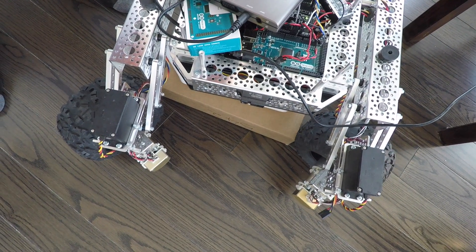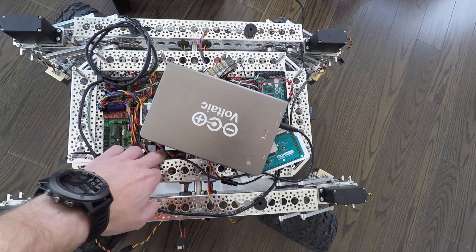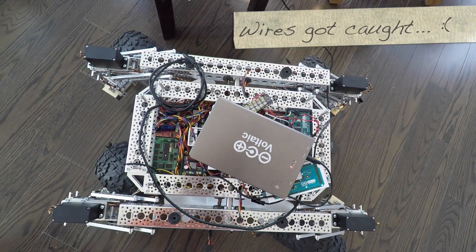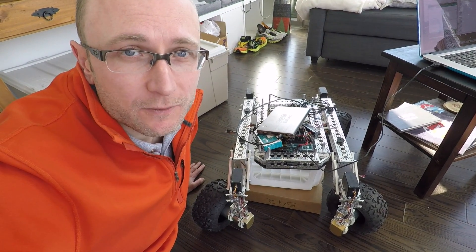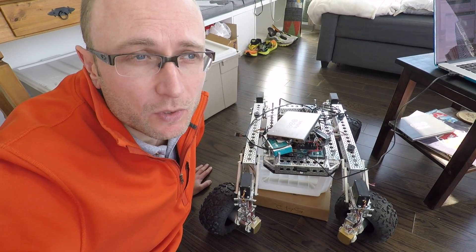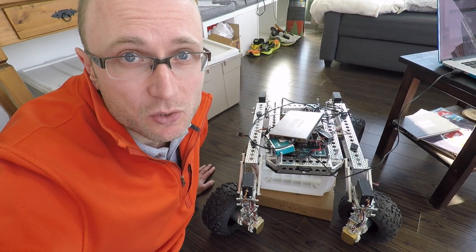Let's see what happens. I immediately flipped the power off. I'll give that another shot — flip the switch and watch the motors, and I'll flip it off again if anything goes weird. So I goofed. What I'm going to do is disconnect the shafts from the lower legs from the wheels so that the servos can turn freely. Right now what's messing things up is I don't know what position value for each servo translates to what position of the tires at each corner. Trying to sort out all four corners simultaneously is too much right now, and I'm worried about burning out a servo or frying a controller board.